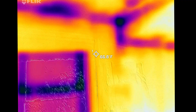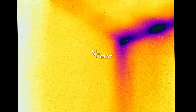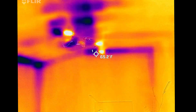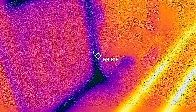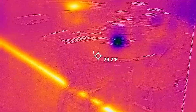The camera clearly identifies cold spots around doors and windows, also around uninsulated wall headers and displaced attic insulation. This use case alone can be very viable in identifying insulation issues in both hot and cold climates.